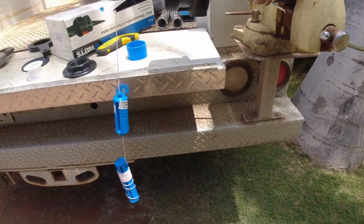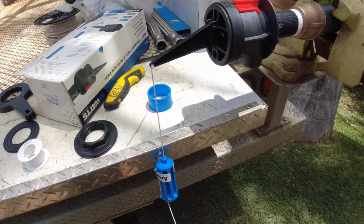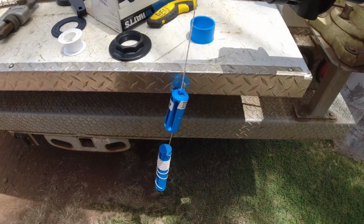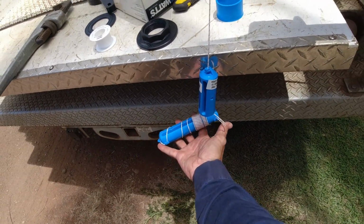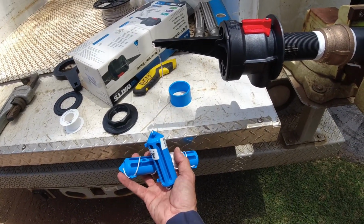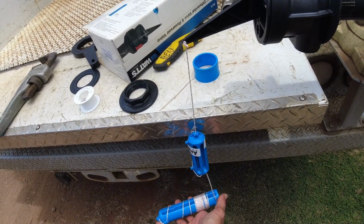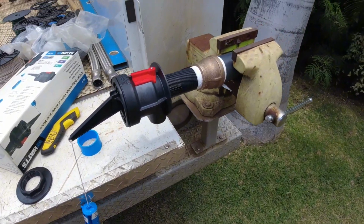Okay, so here's our Apex differential valve and reservoir valve, Big Al from Watts. It's got two floats on it. And the way these work, as the bottom rises, the valve stays open, and then as the top float rises, the valve will shut. And then as the level goes down, the valve will stay shut until the lower one hangs. And you can adjust these strings. We'll do that once we get them in the tank.